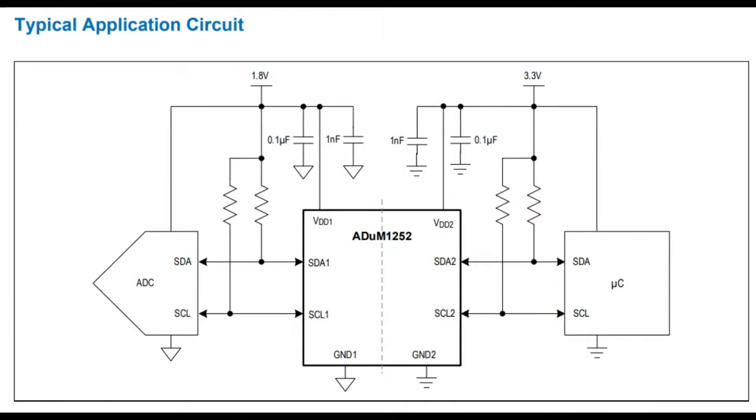Just as an example: if you're doing a robot or a medical device, you have an ADC that you really want a nice quiet power supply for. You have an analog ground, analog power, and you want to be separated from your microcontroller running at 3.3V logic with an earth ground and maybe a messier power supply. This is where the ADUM-1252 and 1253 do an excellent job.